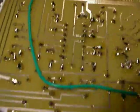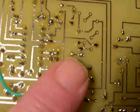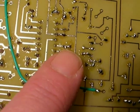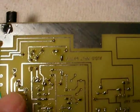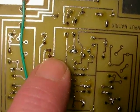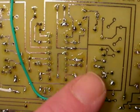That's that circuit now. Audio input problems — this is for the benefit of Wild Bill here. I'll show you some areas that I have found to be problematic. This area in here is very prone to shorting because it's so close — you see how close these two are right here, it's easy to short those two together. Be mindful of that part right there. Same thing over here — make sure there's no short between these two pins over here.